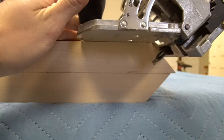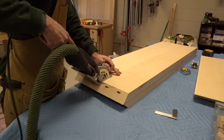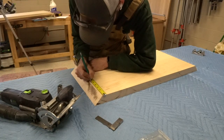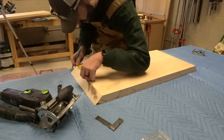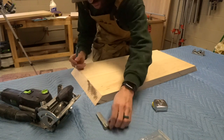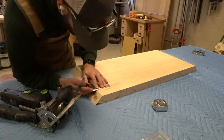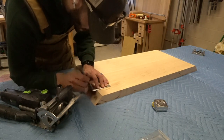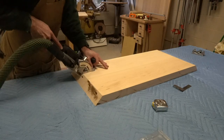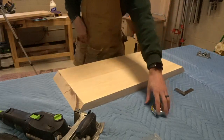Check for depth — make sure you're not going to plunge all the way through. You can use biscuits here; I use dominoes because that's what I've got, but you could do dowels — there's a bunch of different things you can do. Take all your panels, make your marks, and then transfer those lines with a square so that you have a better reference line with your cutter, dowel jig, or whatever you use. And plunge, drill the holes, swipe and flip and drop and continue.